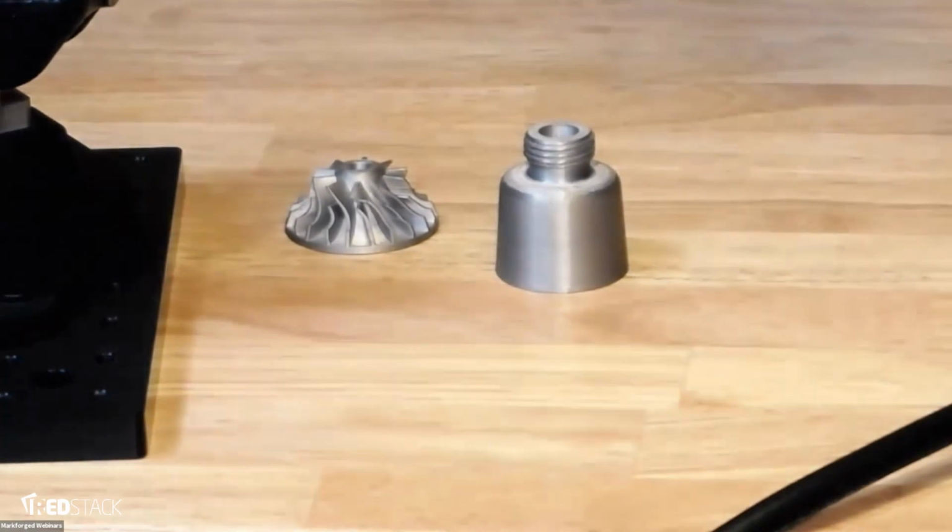Can you use traditional heat treatment to sinter the green parts? No. So the Sinter-1, which is our sintering furnace, comes with the Metal X system as a whole. We use that to sinter it. In terms of heat treatment, the Sinter-1 doesn't currently heat treat, and I would actually not recommend using it for heat treatment because it's probably more expensive to run than your typical furnace, and most people have furnaces. I would sinter it in the Sinter-1, then just use a standard furnace to heat treat.